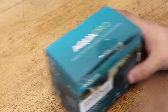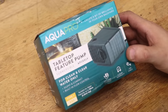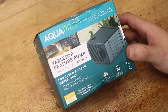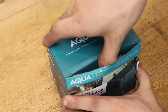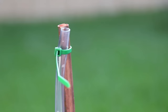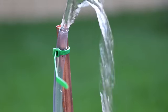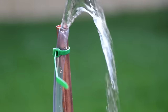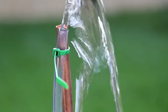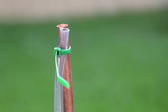Initially I bought a smaller 12-volt pond pump, and it just wasn't powerful enough to pump all the coolant up. These pond pumps use impellers to push the water up, so it has to push against all the water that's already in the tube, and there's no backflow valve — so you really do need a moderately powerful pond pump if you go down that direction. On the plus side, because it's just an impeller and a motor, it makes these pumps really simple, so hopefully that means it's going to last a long time.